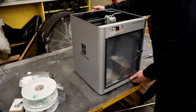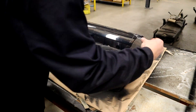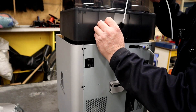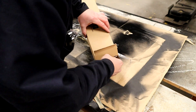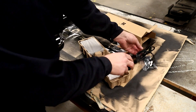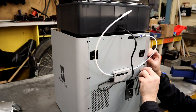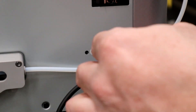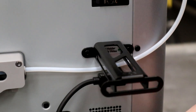Take the cardboard out from around the printer head and remove the styrofoam from the poop chute. Turn the printer around — it'll be easier to work on. Take the plastic off the AMS unit as well as the glass top, then set the AMS unit on top. Take the top tube from the AMS and put it into the top hole in the back of the printer. Find the two electrical cables in the connector box — one goes from the AMS unit to just underneath where the tube goes in, and the other goes on the other side. They have different connector plugs so you can't mix them up. Use an allen wrench to remove the screws where it says spool holder, install the spool holder bracket from the box (it says 'top' on it, so orient it correctly), and snug those up.